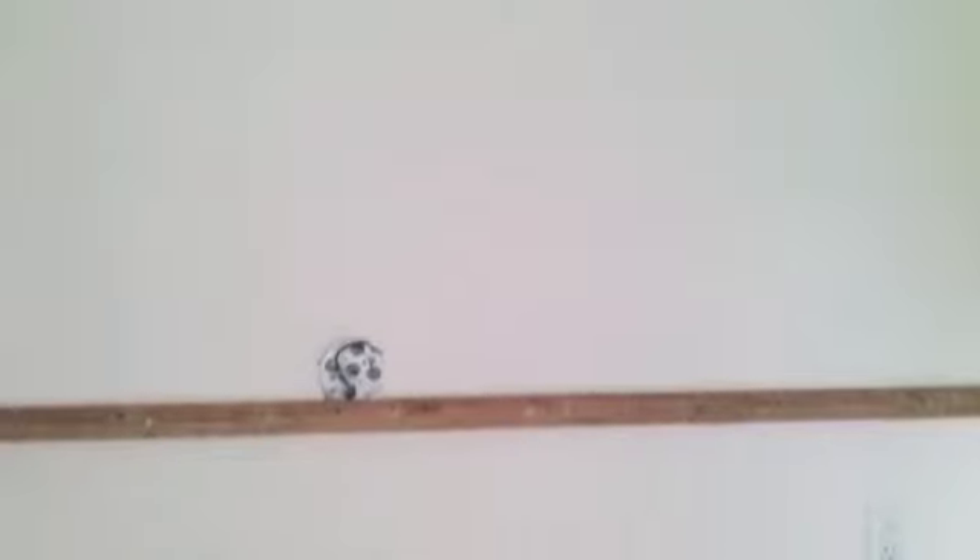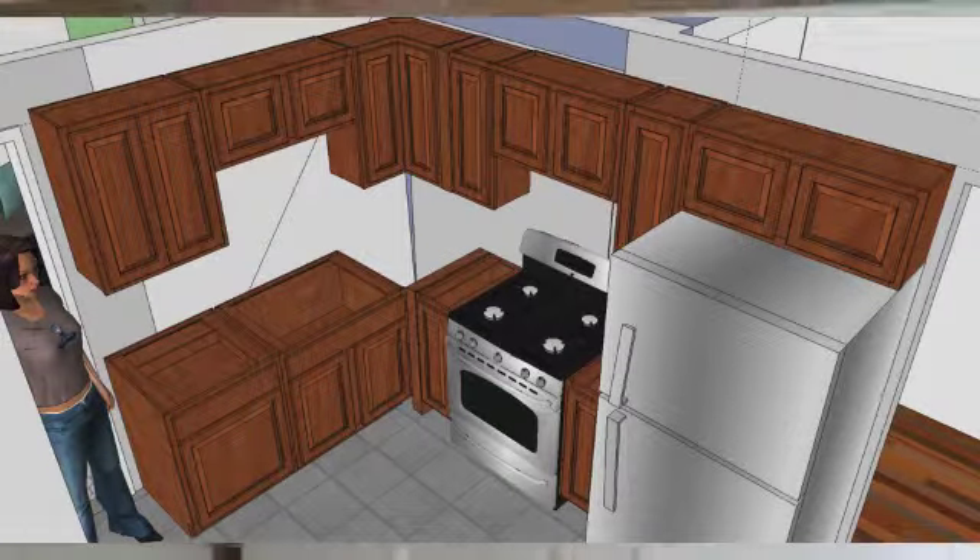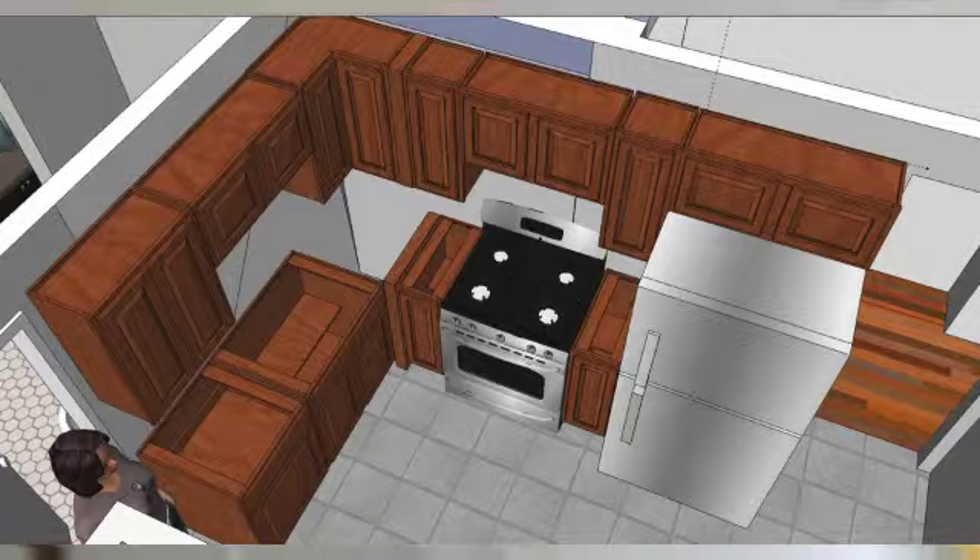This wood is going to be a ledger. I'm working by myself, so I put the cabinet up on here and it will rest there while I screw it into the wall. By the end of the day that'll be all done. There'll be some cabinets down here, but the client opted out on having cabinets on this wall and that wall. This is a rental property, so she said she's not going to spend all the money — and I don't blame her. For right now it'll just be the sink base and the wall cabinets, and your appliances will float on this wall.